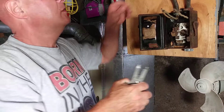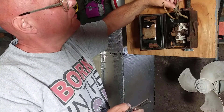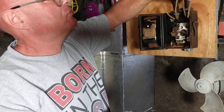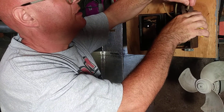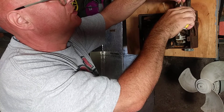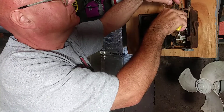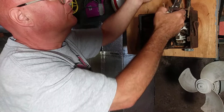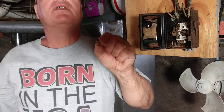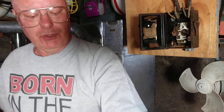Back in the day we had two wires without a ground — a plain white one, and then the one with four darker tracers in it. See the tracers in the wire? That's like our black wire today, and the one without a tracer is the neutral. This is all number 14 wire. You can see the rubber underneath the cloth on this type of older wire — this was very common in the 30s and 40s.